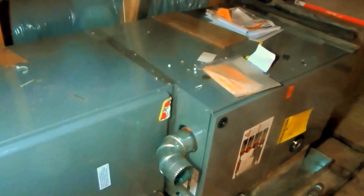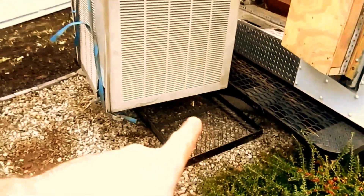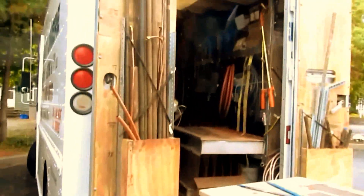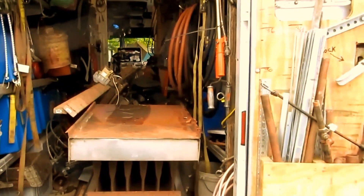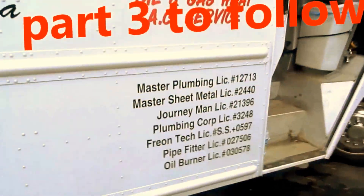I gave him a price on changing the condensing unit, the A-coil, and the furnace — running new refrigerant lines. As far as all the duct work that's existing, that's going to be extra if I got to modify that. I got my little extension on the trailer hitch to carry the condensing unit — got it all strapped down, it's good for five or six hundred pounds. I got the rest of the job on the inside, the old stuff. I'm all done with this job and heading home. It's going to get inspected end of the week once the electrician hooks up the stuff — then I can wrap that duct and I'll talk to the homeowner about increasing that return size. Thanks for watching.